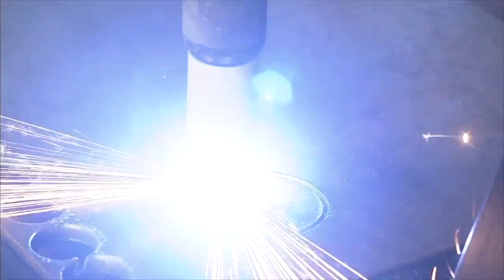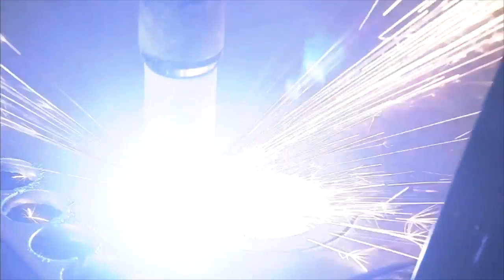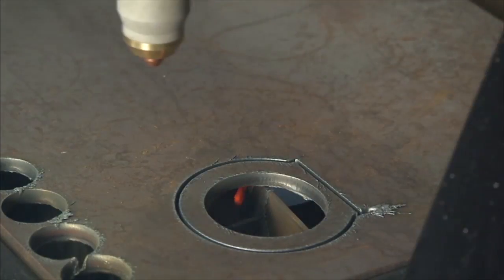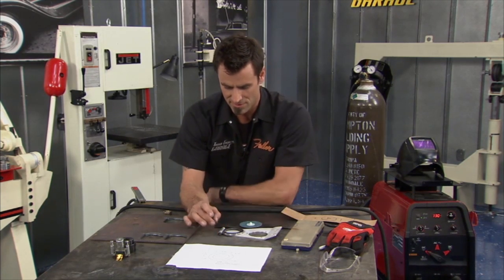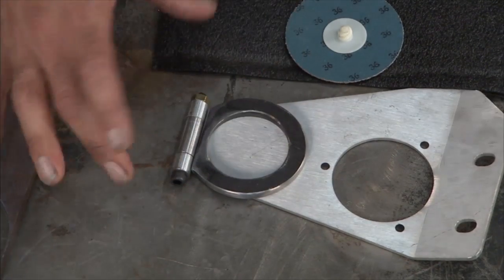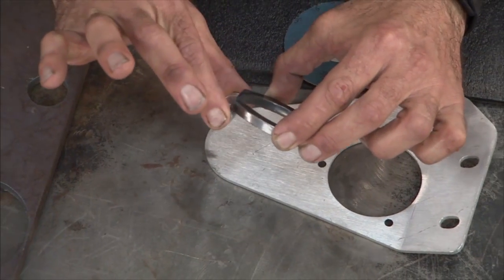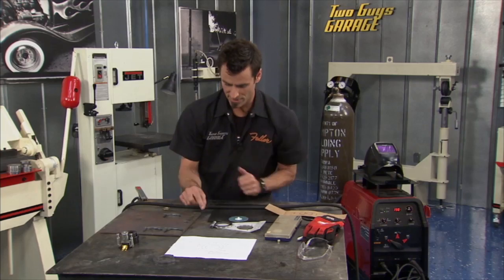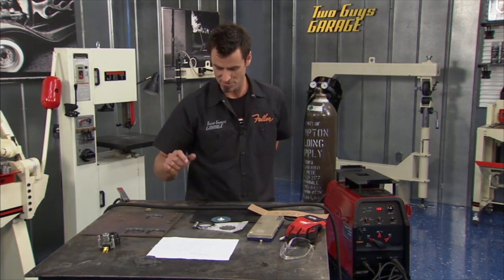This is a CNC plasma cutting system that can do thin material all the way up to one inch. You can take a photo, scan, do a CAD drawing — any shape you want — and this baby will cut it out fast and easy in steel, aluminum, stainless, any material. We did our CAD drawing, brought it back, cleaned it up, and machined a couple of bungs. This is going to allow it to swivel, bolt on and off. I've spaced it up about an eighth of an inch so it lines up once you tack and weld it. I'm going to go ahead and TIG tack these, then move on to doing the other side that goes to the frame.